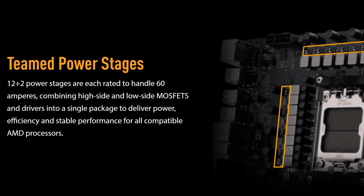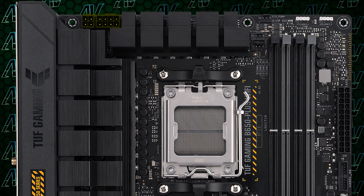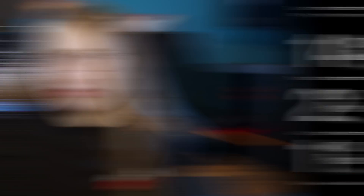Starting off with CPU power, we have 12+2 power phases rated at a maximum of 60 amps. Combined with just 8+4 pin CPU connectors, this is a pretty low-end offering when it comes to CPU power delivery, and compared to many other B650 boards, it's pretty disappointing. For many people this won't make any difference — you can still throw pretty much any CPU in there and unless you overclock it you won't have any issues. But if you're spending this much money on a motherboard, you'd expect features like that to at least be comparable to the competition. You don't want to feel ripped off.